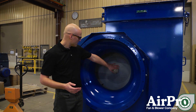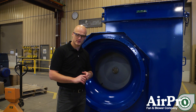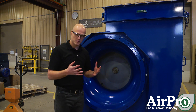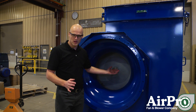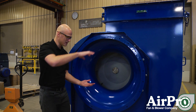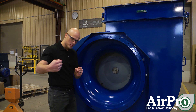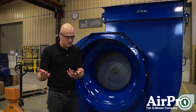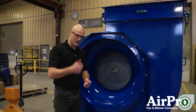How would that happen? We have a rotating wheel inside of here and this wheel is rotating at high speeds — this one will likely be moving at about 1800 RPM. As that wheel spins, it's designed to not come into contact with this inlet bell or with the housing on the back of it, but there's a potential when you install this fan that you could put too much weight on the inlet and shift it so that this bell actually does come into contact with the wheel, or maybe you put the wheel back in too close to the inside of the back housing. There are ways where a ferrous material could come into contact with a ferrous material and cast a spark.